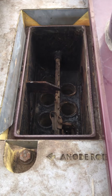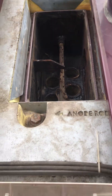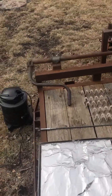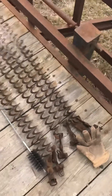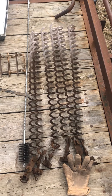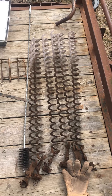Move that handle back and forth a half dozen times and your heat exchanger is clean. Once a year I'll pull these out, vacuum out the top for spring cleaning, and take a bore brush — which is included with your boiler — and clean them all out really well. So this is the ideal maintenance approach.